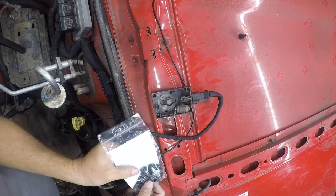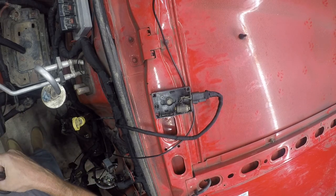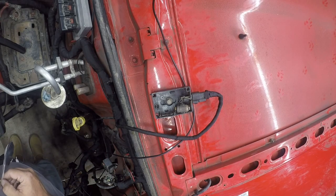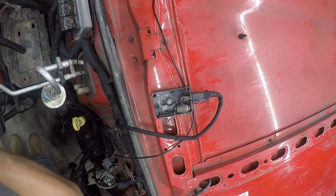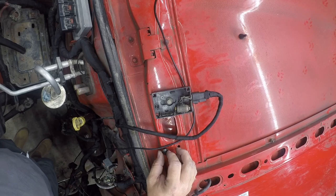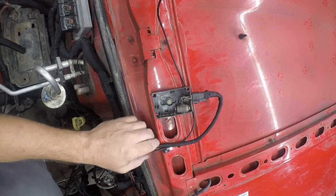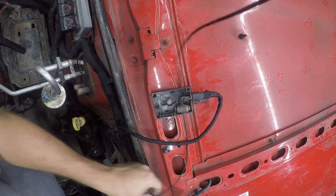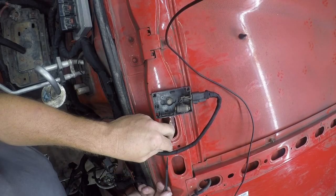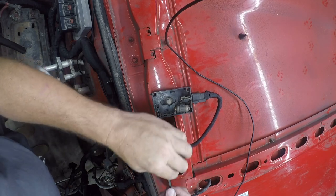I think this is probably the right size anchor, so we're going to see if these work. I ordered these from Mouser — they're an electronic parts supplier; I couldn't find these anywhere else. So those are the right size — these are the 6.3s. What that does is anchor in, and then you can come back with a standard zip tie. The idea is that once you have an anchor installed, you can slide a regular zip tie through here, and now you have a serviceable connection that is easy to change out.